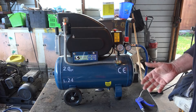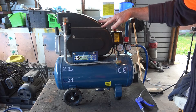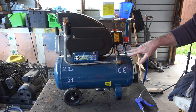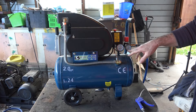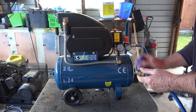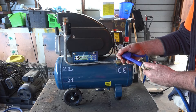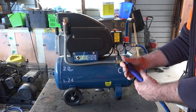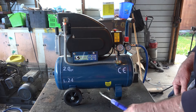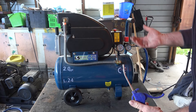The first thing we need to do before we go pulling our plasma cutter to bits - just check whatever compressor you're using, make sure the air is actually turned on, make sure your regulator is set to whatever it's supposed to be, and just make sure the thing's running. Detach the end from your plasma cutter, plug an air gun into it, and just make sure we've got air coming out of the end of the hose. We've got air coming out - beautiful.